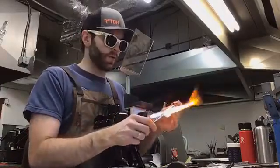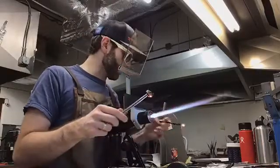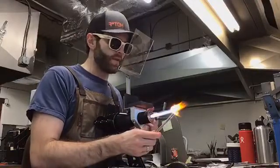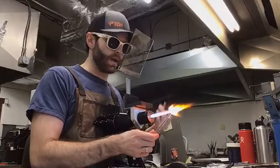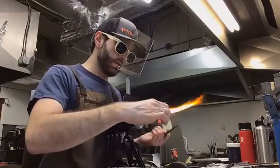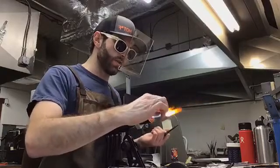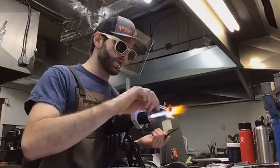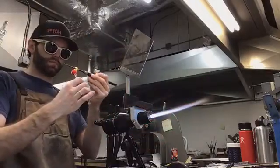So again, those steps are just slightly modified from the most broken down version that I covered at the beginning of the video. But those 3 steps are the key components to what I just did. They're just slightly modified for me to go a little faster and make the loop a little more fluid. Now I'm melting in the connection points, just like I did in the other loop. Working on the base of the loop first, getting all that glass flowed in so I know how much I have to work with as I do the final shaping of the loop. Now I'm heating up the whole loop so it can shrink a little bit. And I'll do some shaping.